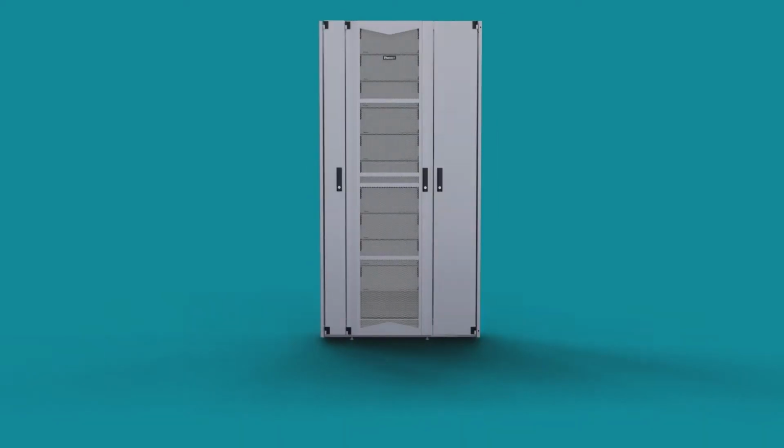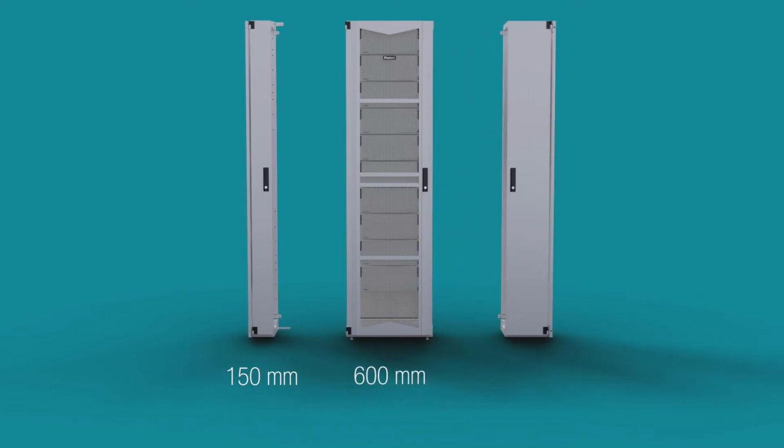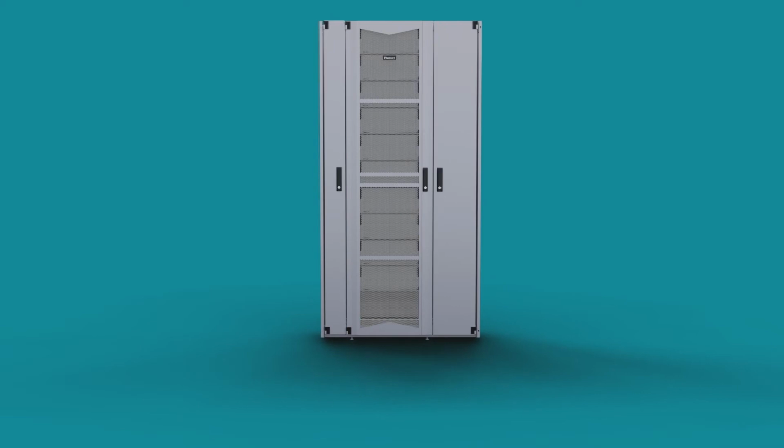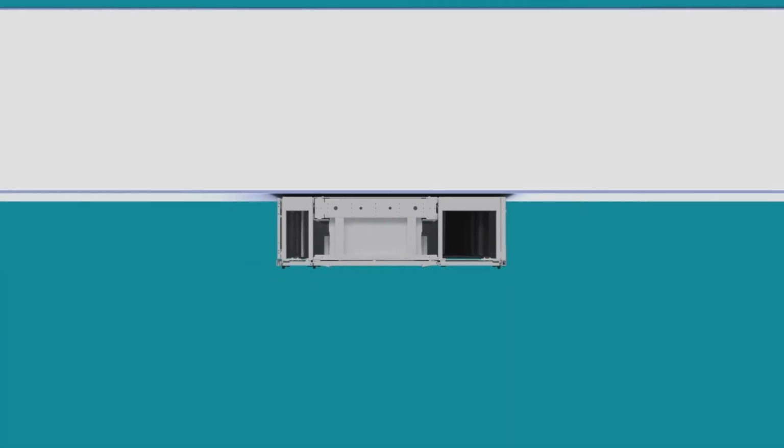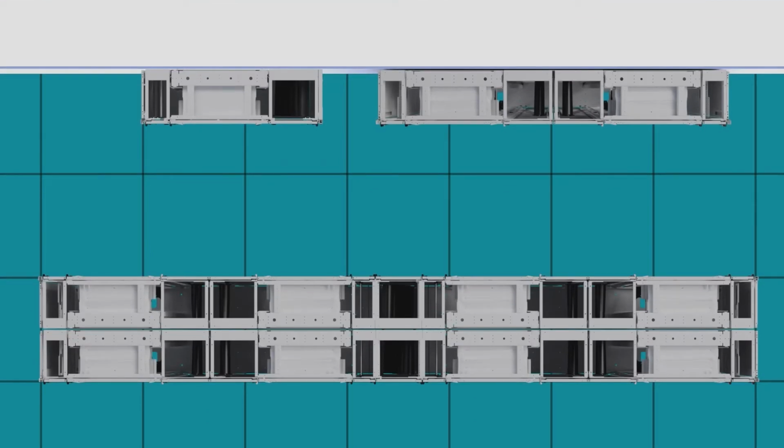critical circuits. The FlexCore system utilizes three modular building blocks, comprised of a 150 millimeter wide vertical cable manager, a 600 millimeter frame, and a 300 millimeter vertical cable manager that can be used to create the exact configuration to optimize density and system availability. Typical frame arrangements are wall-mounted single or double racks and middle-of-the-room back-to-back configurations.